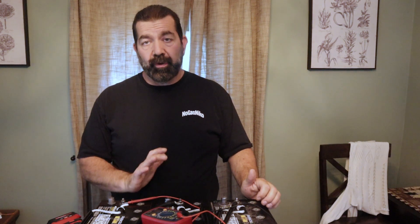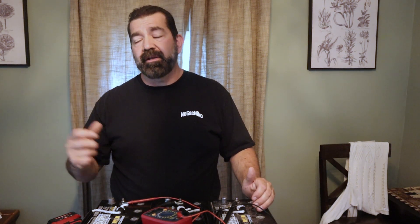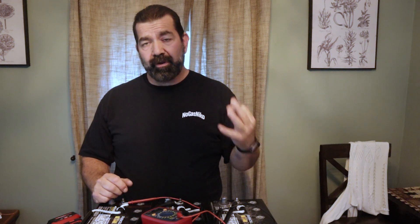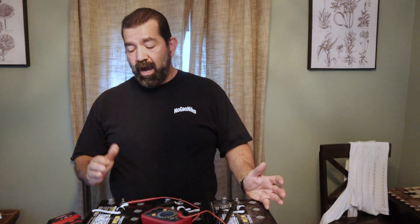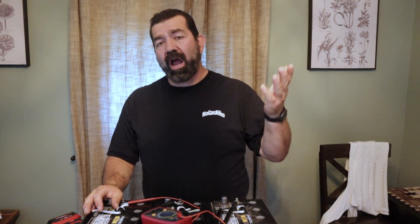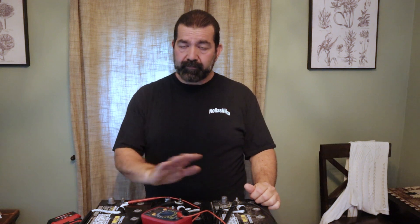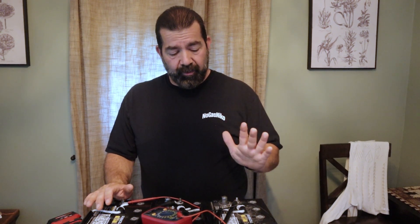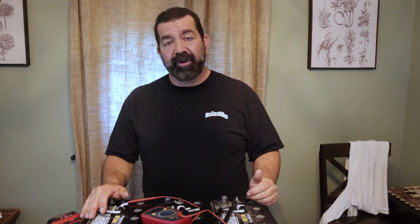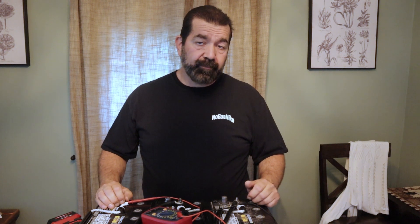So you're able to run smaller cabling, which is my goal with this system. I'm going to run it into a 48-volt system once I upgrade my charge controller. I have a 30-amp controller right now and can only run three 100-watt panels off it, so I'm going to upgrade that to a 48-volt setup. But I have to get another battery to make this 48 volts. Don't forget to like, share, and subscribe, and click the notification bell so when I upgrade to the 48-volt system you'll get notified. For right now, I'm going to connect this in parallel to my 12-volt system and get it back online, because right now I'm running on grid power and I'd like to go back off-grid. Thanks for watching. God bless.